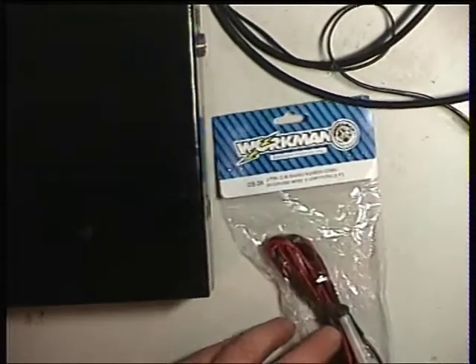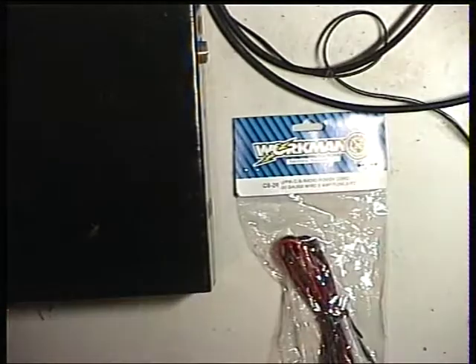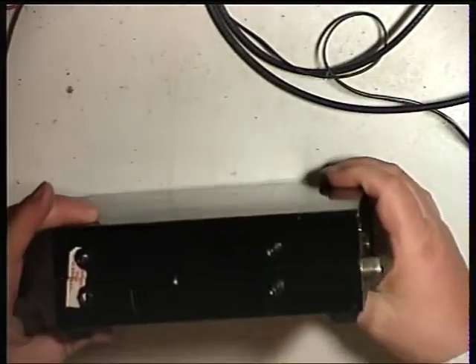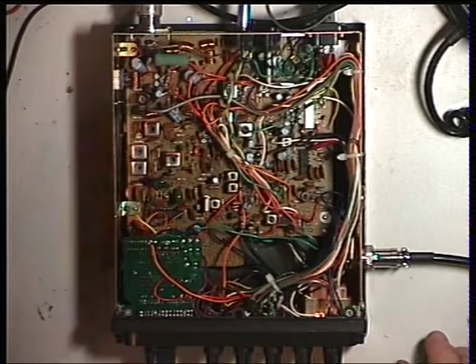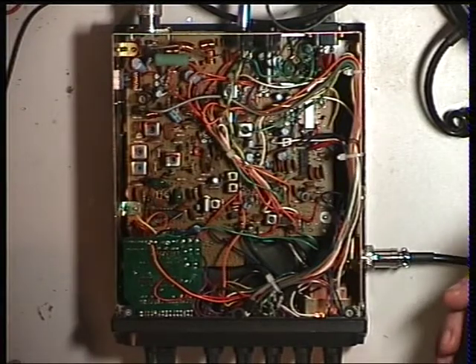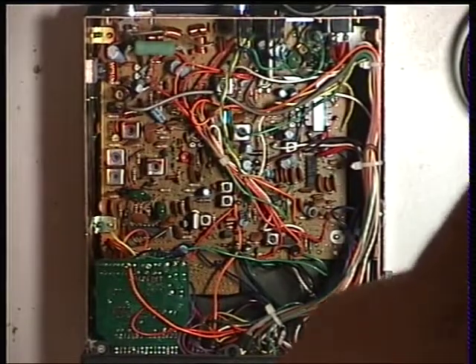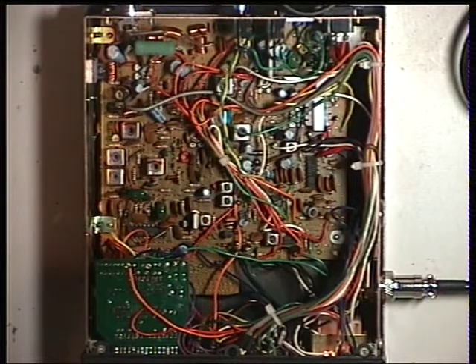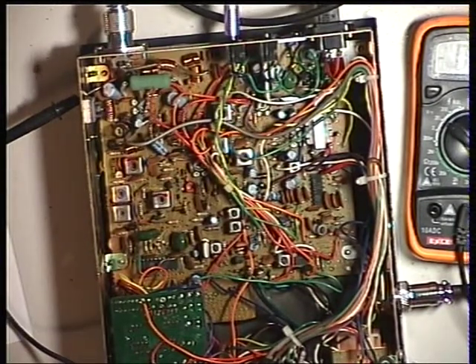This is an American firm with plenty of distributors. I've made up a mic because it didn't come with one. I've never opened this particular setup — I've only ever seen one of this version before. It looks like it's been used as a base station; someone's put bump-ons on it. I'll open it up and see what's inside. It looks perfect. A quick transmit check and a quick receive check — it's doing both basic functions. We'll now check the VCOs.